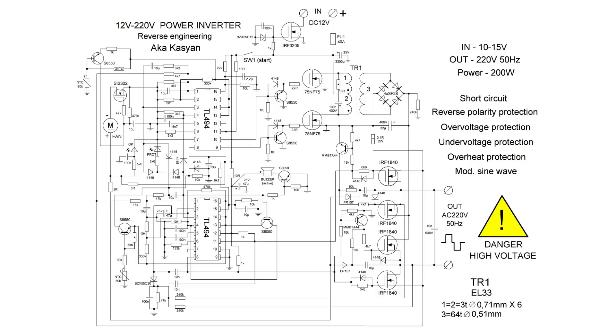Now the diagram is created — let's look at it. It consists of a power inverter which raises 12 volts to a high DC voltage, and an AC voltage generation unit which is a conventional H-bridge on high-voltage N-channel MOSFETs. The converter is classic, built on push-pull topology: a pair of powerful MOSFETs acting in turn create a pulse current in the primary winding of the transformer.